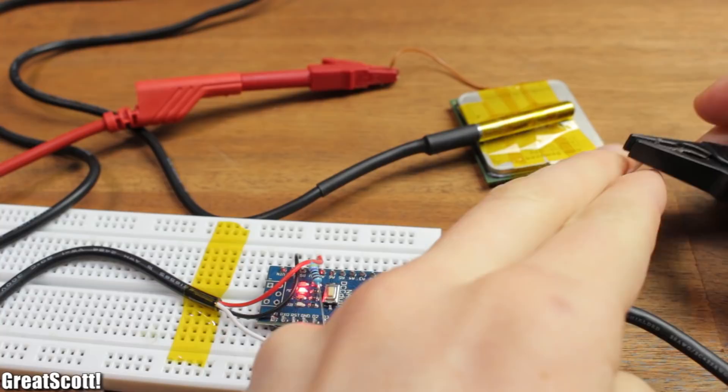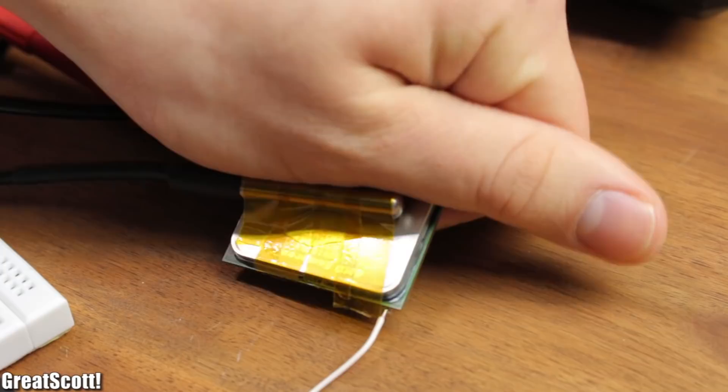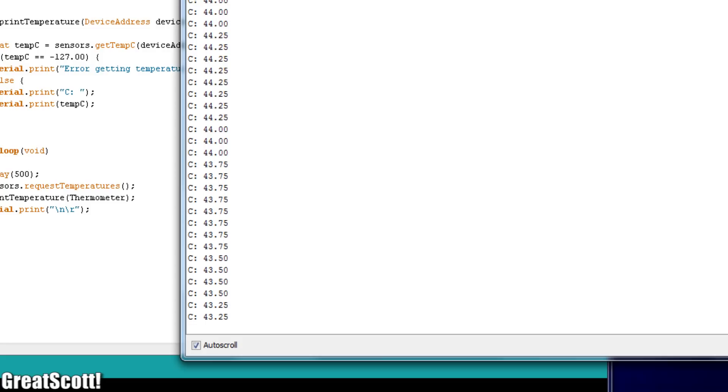Time for the first test: I powered the CPU and used a small sketch for the Arduino to output the temperature over the serial monitor. It works, but it's taking so long — I waited around 10 minutes to reach 44 degrees Celsius. And when I put my hand on the heated surface, the temperature drops really fast and takes a long time to recover. So under 500 milliamps and USB 2.0 is not realizable.